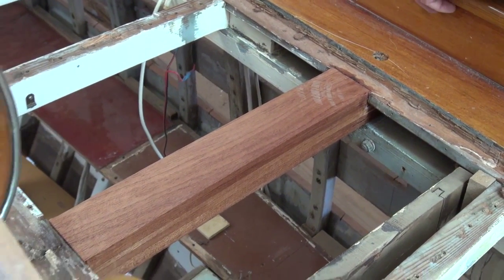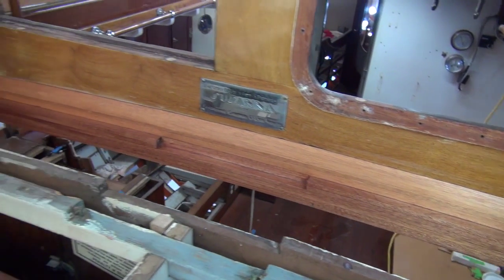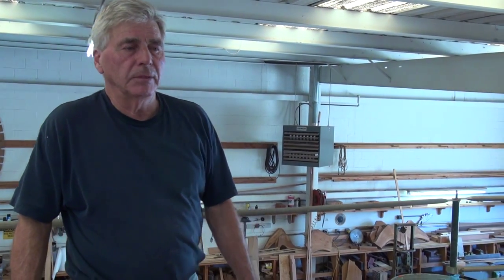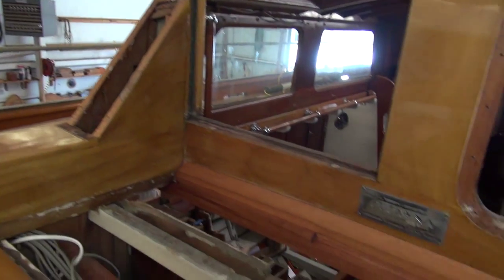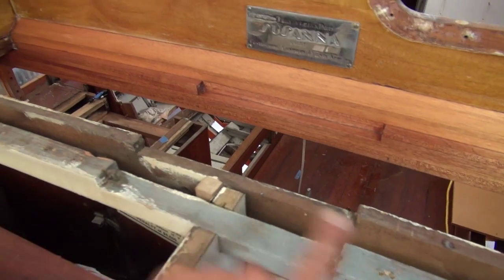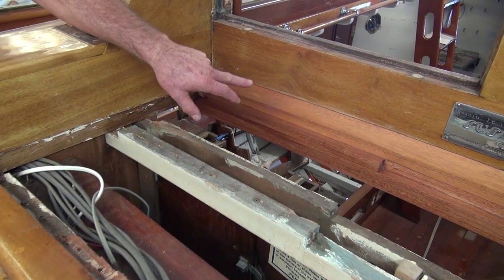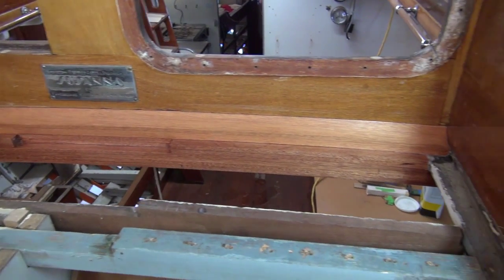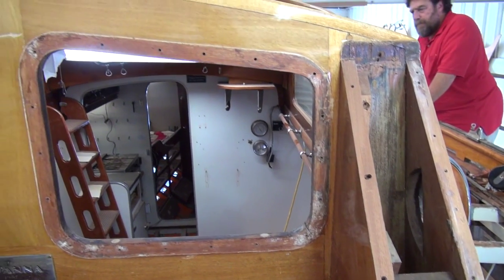And then this is the famous log made out of Honduras mahogany — that piece is glued to the underside of the cabin back. And of course the deck being two layers, right here in the middle you've got about eight layers — six plus two for the log — going all the way across. So what kind of shape was it in? Remember we stuck a screwdriver through it. Our worry was that the cabin back was rotten, but luckily it was intact — it was just that log and the beam, mainly because of fresh water standing in those corners. We had all kinds of funny stains, and this was pieced in in a few places, which is always a bad sign.